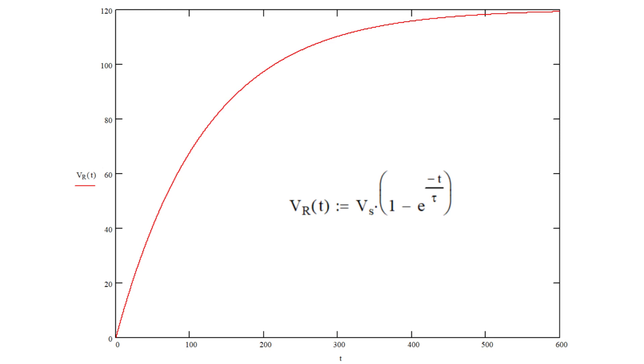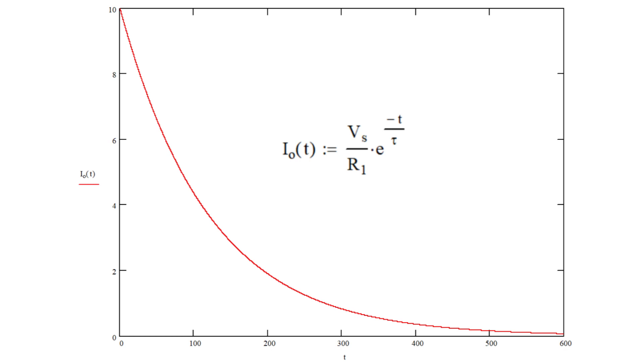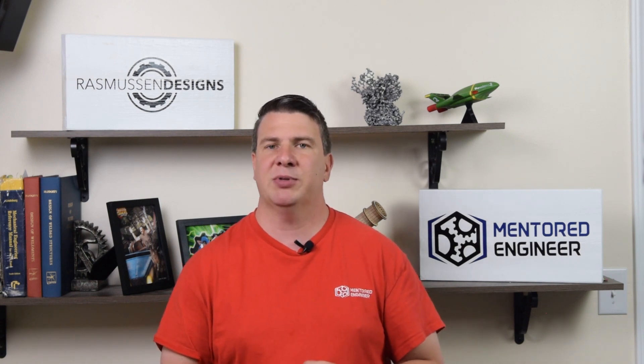A standard capacitor will follow this charging equation - it starts at zero volts and moves up to the maximum voltage, going very quickly at the beginning and tapering off towards the end. The current will behave opposite to this: very large at the beginning, then tapering off as time goes on. If I'm plugging this into a wall that's going to pose a problem. We need to limit that current coming out of the wall - I want to limit it to 10 amps. At the very beginning the resistance across the capacitor is almost nothing and the resistance in our wire is almost nothing, so theoretically we're pulling an infinite amount of current.